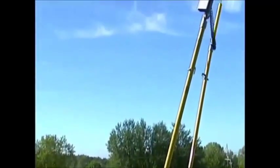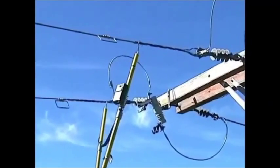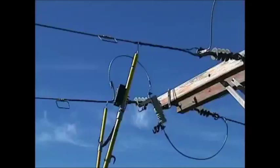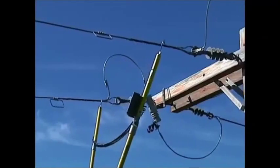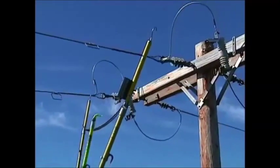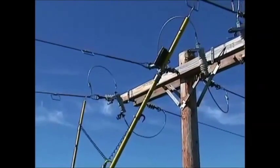Let's go out on the line a little bit to keep that cold cord away from that ground. I have 12.5 here, phase to phase, which is 12,470 — that's logical. I'm going to go out to that road phase. Do you want to pull that cord down just a little bit? I'll go on the bottom side of this stirrup and get a little more clearance.